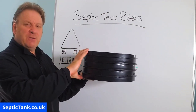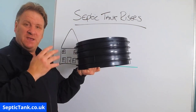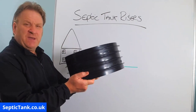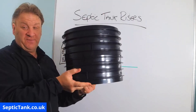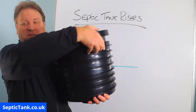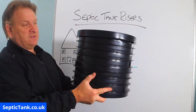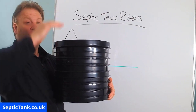Typically they can range from anywhere from 150mm all the way up to 1000mm in height. Diameter-wise they can range from 360 to 460 to 600mm. They all come in sections — you get one section, you can put another section on top, and then the lid goes on top of the riser. They're called risers because they form like a chimney stack, and most risers will safely go up to about 1000mm.